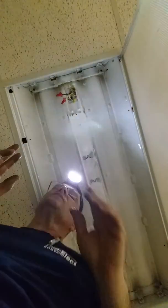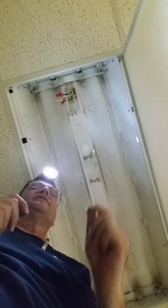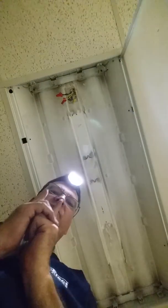Now, you don't need to twist these wires around. You don't need a mechanical connection per se, because if you do that, it's fine. It makes a good connection. Again, I'm going to push and make sure. This wire was a little tricky, but it's good. It was a little bit tough in the beginning, but I got it. If you were to twist those wires around that connection, in the future it's very difficult to undo. The wire is so much smaller. You want to have these so that they separate easy.